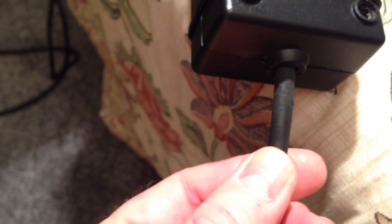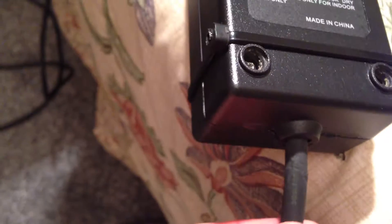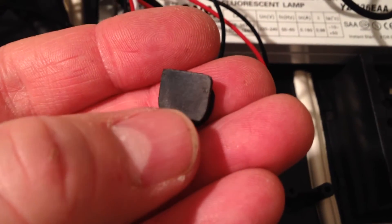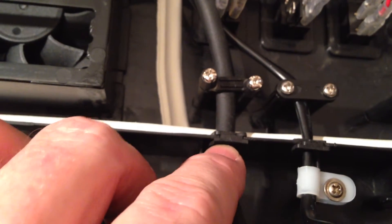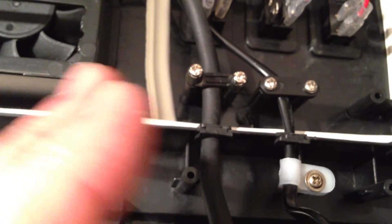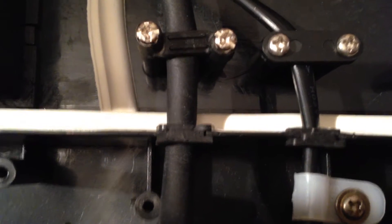I've opened the adapter up and used some exterior rubberized 3-core cable, left over from when I installed the central heating over the summer. It's held in place with a cable tie and soldered inside. I've left the lead really long and run it through the slot in the back through this rubber. For the rubber grommets - there are three fitted for the other light modification - I drilled a small hole in the middle, sliced it open to the curved end, and nipped some out with side cutters. Because the cable is very soft rubberized, it seals at the bottom where the plastic curves.